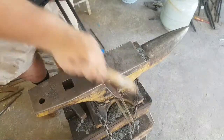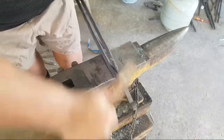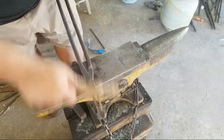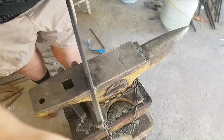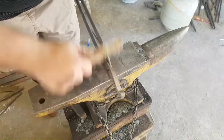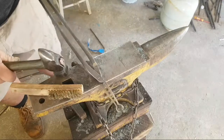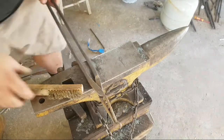This is actually some of the most effort-intensive bits of doing these, the brassing. Still a little bit too hot in the jaws, in the bosses, I should say. You can tell because it turns purple right there. Because brass oxidizes black when heated. Tighten those jaws up a little bit. There we go. Nice and tight.